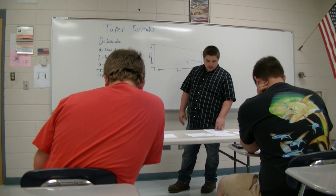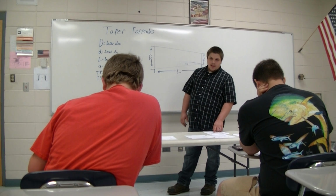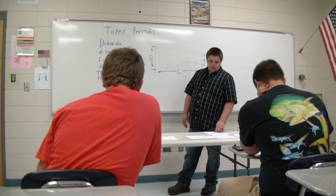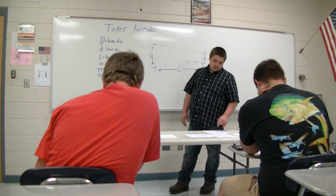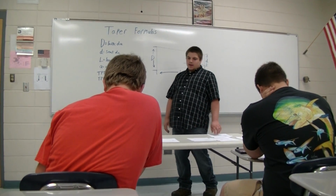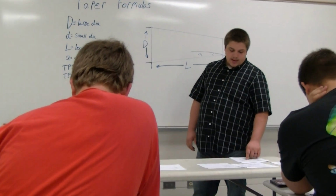So it says you have 52 thousandths taper per inch. Multiply that by 6. Divide it by 2. You're going to come out with 312 thousandths divided by 2, which gives you the same answer of 156 thousandths for that formula. And then there's one last formula that says if no taper is given.